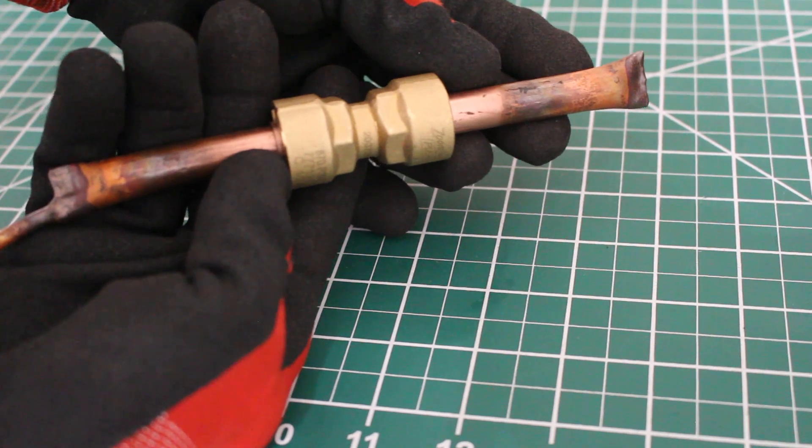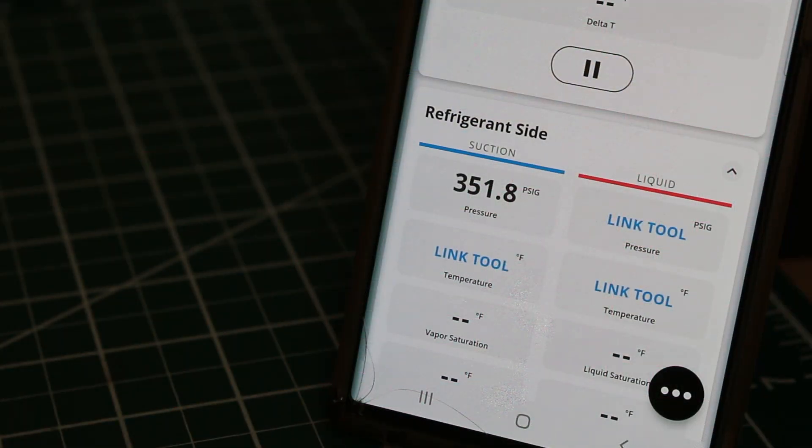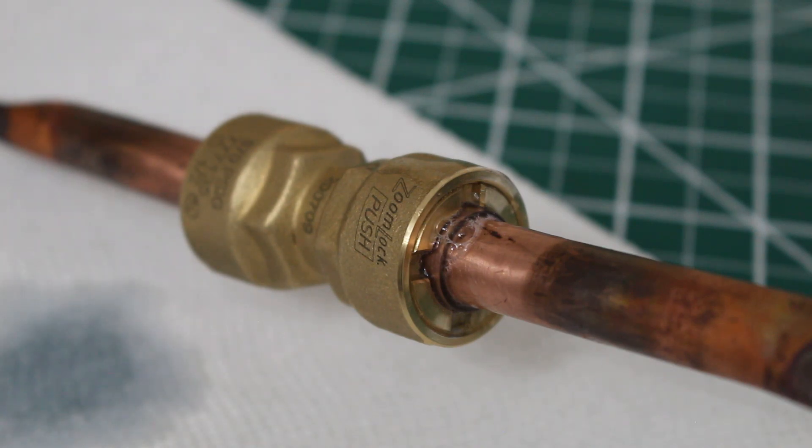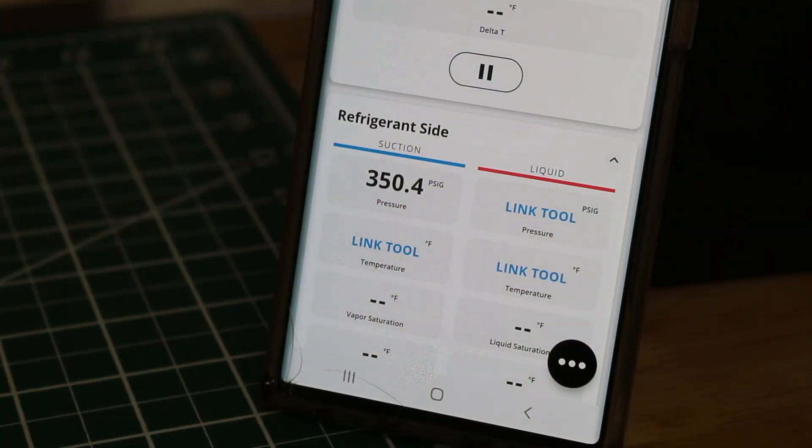I got the pipe off and I'm going to put the same one right back on. Let's try it again. The pressure in the line right now is 351.8 PSIG. It seems like it's dropping slowly. We just lost a tiny bit — let's take a look at the fitting itself. We do have a little bit of a leak. You can see some bubbles, indicating there is a leak. It seems to be a bit smaller, but we do have less pressure at this point and it's definitely leaking. We are clearly losing pressure. I made up another piece, so let's go ahead and remove the side that was leaking and try this one more time.